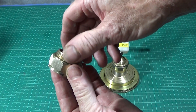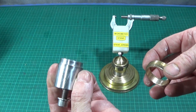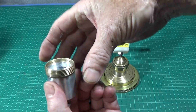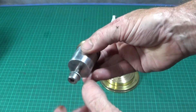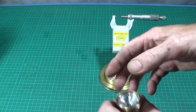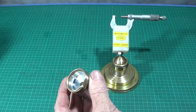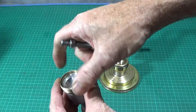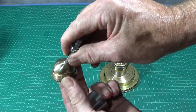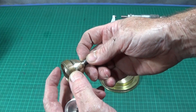That's the part I've just machined. I've made up this piece out of a bit of aluminium and this one will push down on the top with some Loctite 638. This one is tapped for an eight millimeter thread so it can be put onto the brass plate, and it's been drilled out a bit in the middle so that when the ball goes in it doesn't actually make contact with the aluminium — it's making contact with the threaded part. You have to give it a bit of relief to allow for this part of the ball.